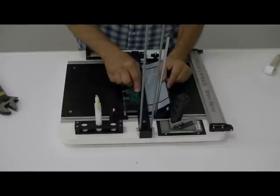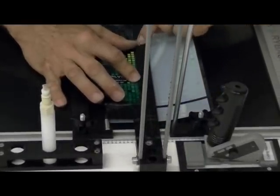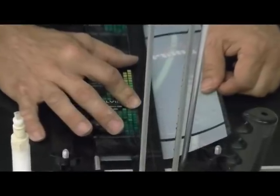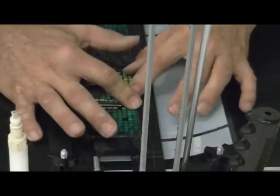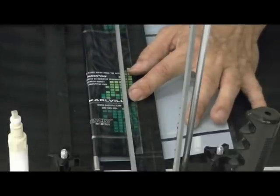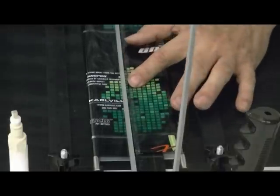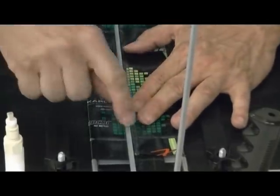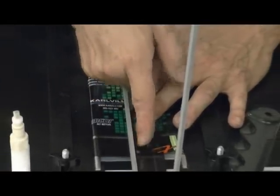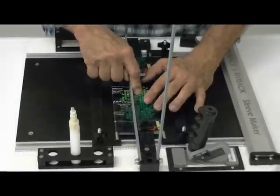Once that finger's in position, I'm going to fold the web over. I'm trying to line this up to the left-hand engraved line in the center section. As I line it up, I'm pulling tight to be sure I'm perfectly straight along that line. Once I have it in position, I'm going to lower my right-hand clamp. The clamp is held in place with a magnet so it can't move once you lower it. I'll then lower my left-hand forming finger and gently fold the material over. There's a line on the right-hand side of the center section that lines up with the edge of my five millimeter clear area at the top and the bottom. When that lines up, it gives me a seven millimeter overlap, which is sort of an unwritten industry standard.